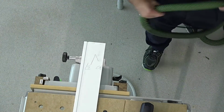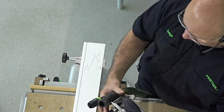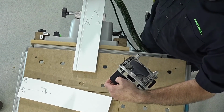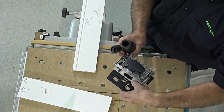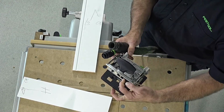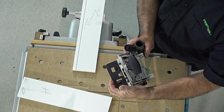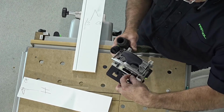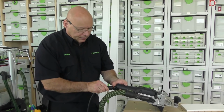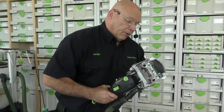And this is important. Whenever I'm starting to manipulate these wings here, like I'm going to be going 20 from the top on here. Okay, 37, I'll use this flap. Okay, but when I'm plunging vertically from the 20, I bring this out. And now that gives me, look, this is why I wrote 20. From here to the center line is 20 millimeters. Okay, so now, here's the thing I got to coach you on. I got to verify everything before I start. Okay, I got it set at 20. I'm bottomed out. I'm ready to go.